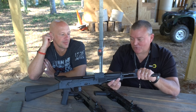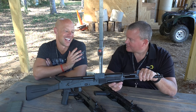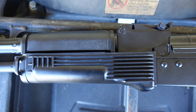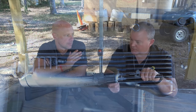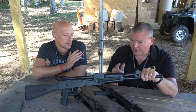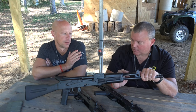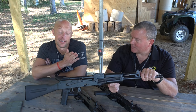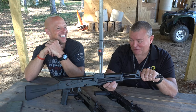All US parts — gas tube and handguards included. The furniture is DDI's military black plastic MVP, a military-grade polymer with steel inserts and a steel liner, featuring a higher glass content than most competitors. In a 'mad minute' test, 12 magazines of full-auto were fired through a test gun while pouring water on it to cool it down. The plastic smoked but was completely unaffected, and the shooter got a burn from touching the sling point but not the handguard.